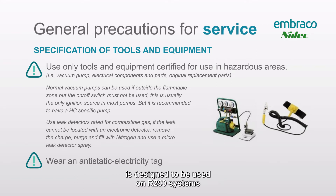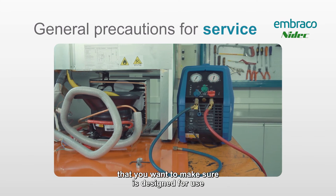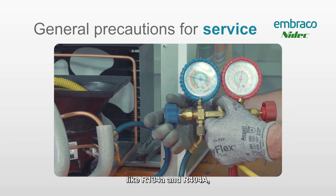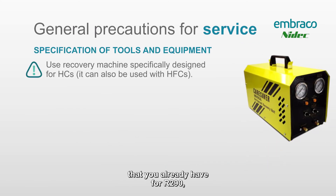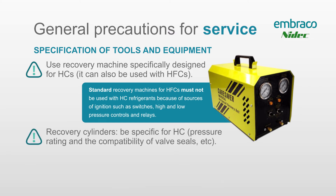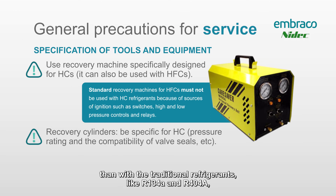Make sure all of your equipment is designed to be used on R290 systems and in an environment where there's potentially R290 gas. A recovery machine is another piece of equipment you want to make sure is designed for use with an R290 system. You can use an R290-approved recovery machine for older traditional refrigerants like R134A and R404, but you can't use your older recovery machine for R290 because it may have switches, pressure controls, and relays that are potentially spark-producing. Always make sure you have the appropriate R290 recovery cylinder, as these gases have different densities and will react differently with seals and other components, and can be filled to different amounts than traditional refrigerants like R134A and R404.